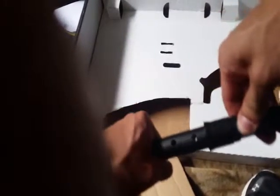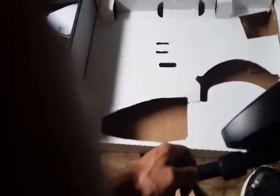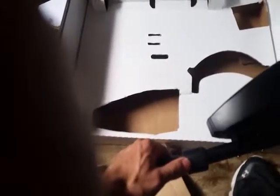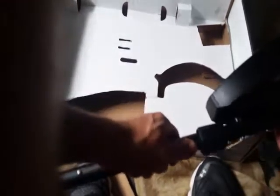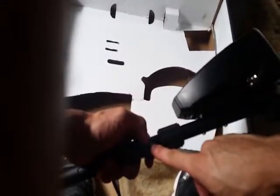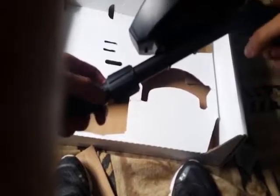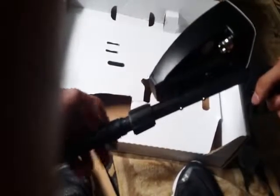And from there, alright, so push those in. It's much easier, this thing is standing up. That way you use the body weight of the mechanism as you're holding this in one hand and stabilizing the mechanism with your other hand. So you push these in as this whole machine is upright, vertical, and then the weight of the mechanism itself pushes the pins into the body.